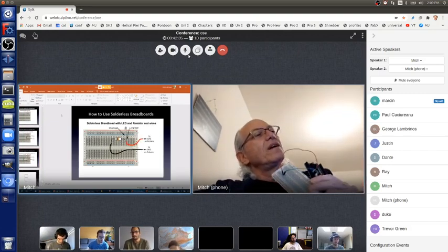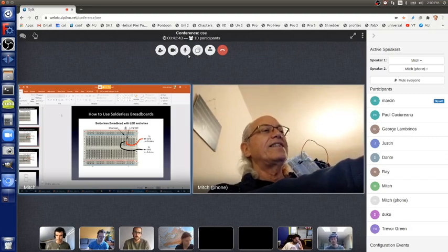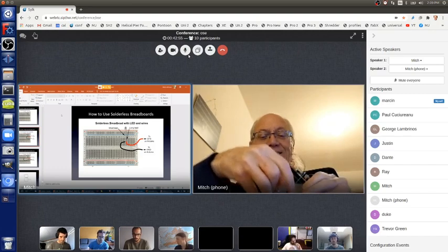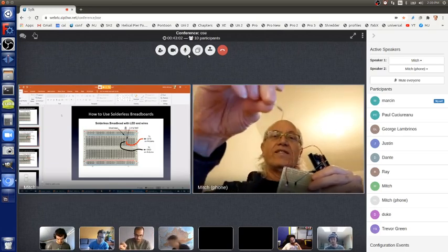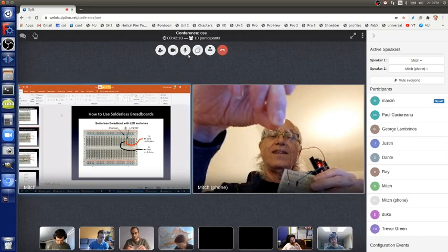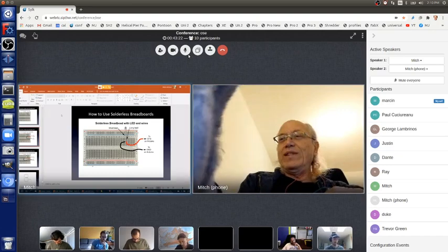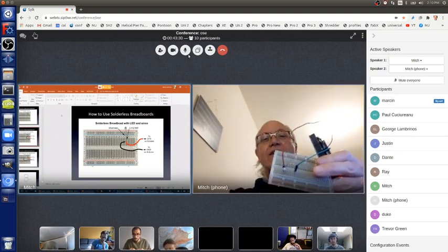So here's what I have now. I can pull out this black wire so that it's not connected in my actual circuit, the green wire. I can pull it out and leave it somewhere, it doesn't matter where, as long as it's an empty column. Then I can take a resistor, which happens to be 1 kilo ohm, and connect it to that green wire, and then take the other side and connect it to the short wire. I'll put the cat on the ground, which always helps. And check it out, the LED is blinking, but dimmer than before.